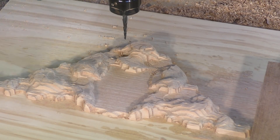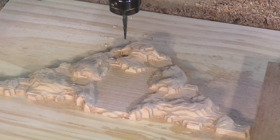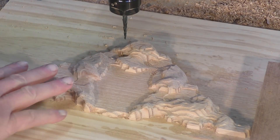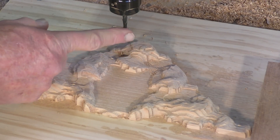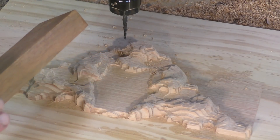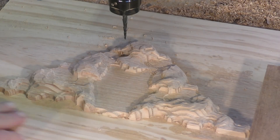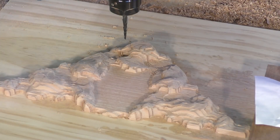That's the roughing cut done. You can see there's gentle contours rather than a square blocky cut. This is the type of roughing that I would prefer. Now we've machined this away, there's none of the original material left. So to be able to set the new Z height for this new tool, you simply get a piece of material of the same thickness, put it anywhere on the surface of the backing layer, and zero off that.